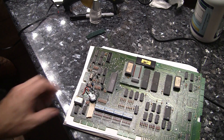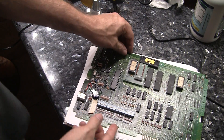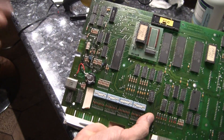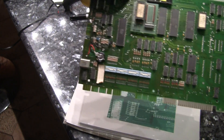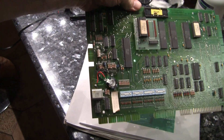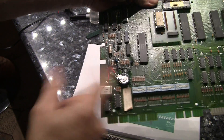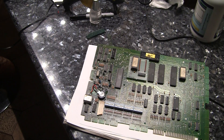Let that set up, and then we'll have a board — a new revised Gottlieb System 80B with a memory cap instead of a regular NICAD battery, which leaked crap. It just barfed all on the board. This board is not really too bad, but some of them get really, really messed up, and it's not cheap to replace these boards.